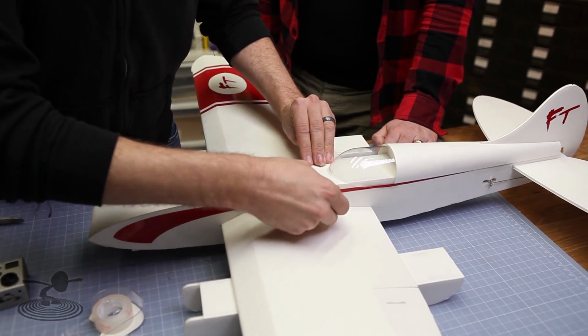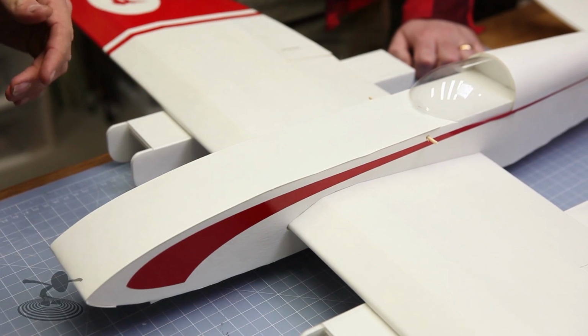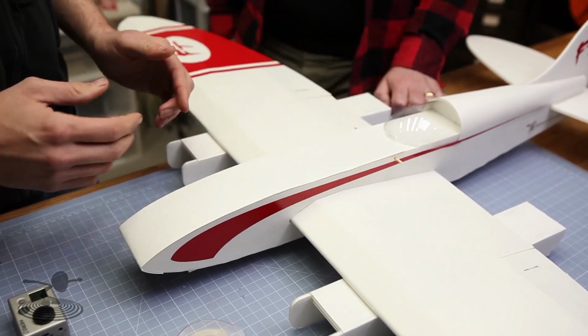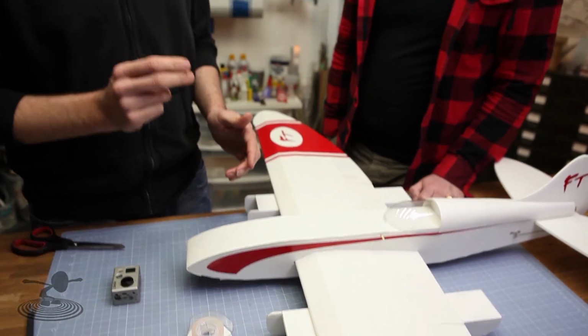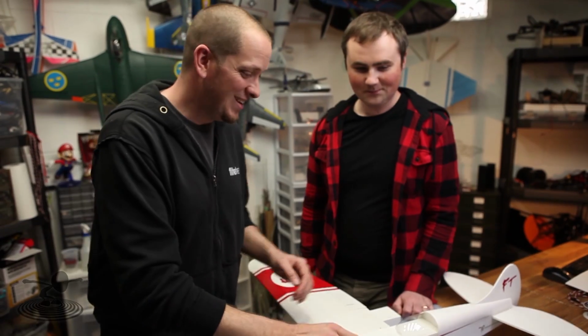That looks really sharp. Now always keep in mind, if you're using a board camera, you probably won't have to move your battery at all. But if you're using the GoPro, you're going to have to slide it back a little bit. But always keep it a touch nose heavy, not tail heavy, because when these things get tail heavy, they get very pitch sensitive. And it's flyable, but not fun at all.